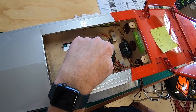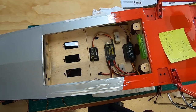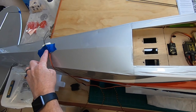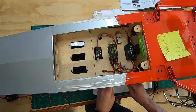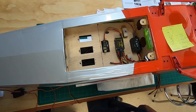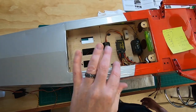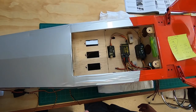We did a proof of concept video of it all laid out on the bench. Basically what we've got going on here is a FRSky Redundancy Bus, which controls receiver 1, and then receiver 2 is going to be mounted way back in the tail boom — that's an XM Plus. Then our channel expander, and the two battery leads are hanging down here, so we've got twin batteries too. Basically if we have a receiver failure or a battery failure, we're good to go — we have redundancy of both. This was a lot of off-camera stuff: laying stuff out, velcro, gluing antennas in and whatnot, so we saved you the boring part.